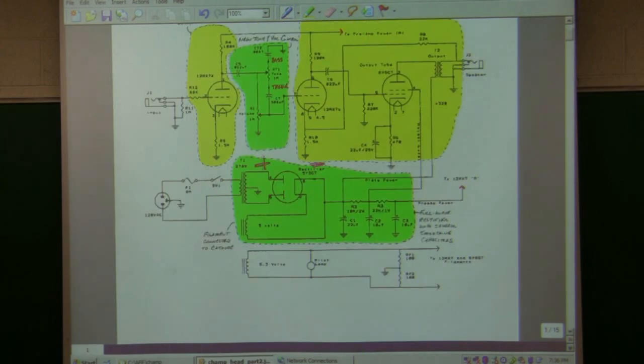So what was happening, I'll go back to the first page here. The voltage across this diode is pretty large, and so if you drew more current for the load, then you draw more current through the diode and you drop more voltage here. And I watched this voltage go from 220 volts to 150 volts. And then it would recover after that waveform went away. But it takes several seconds for it to recover.